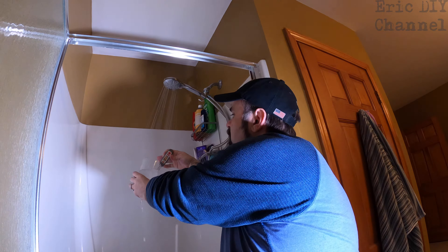Your shower is now at the temperature you desire. Just remember: left on that little adjustment screw to go hotter, right or clockwise to go colder. That is how you adjust the temperature on your Temptrol shower faucet. If you like this video and want to see more, please give us a thumbs up and hit that subscribe button, and push the bell notification icon so you'll be notified of future Eric DIY video releases. You can also contact Eric at eric5150DIY@gmail.com. Have a great day!